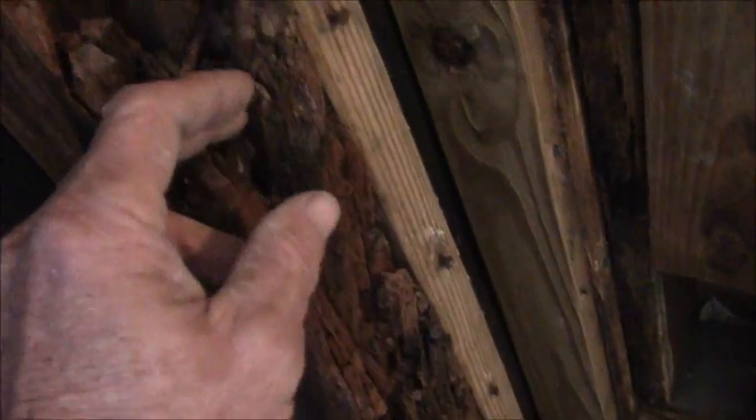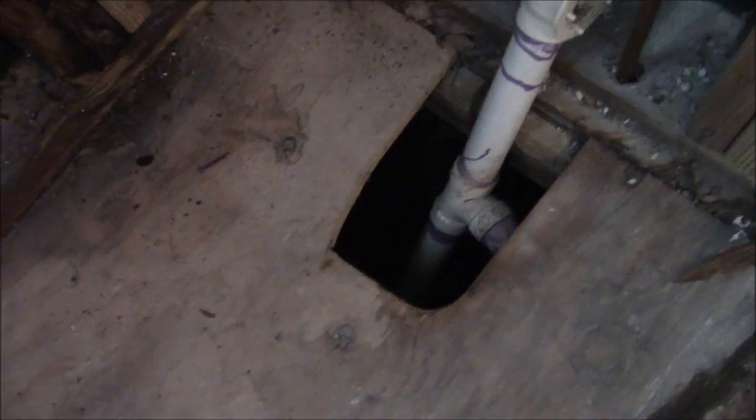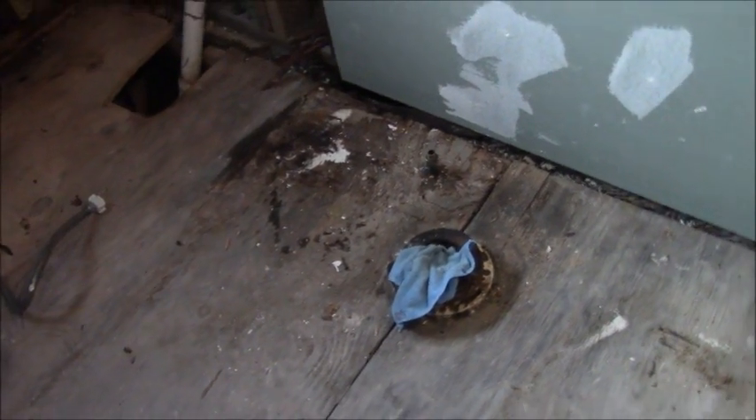There's a lot of prep that has to happen. All this wood looks like it's been through a fire — it's really rotted bad — so I have to refasten all of it. The drain broke off and I won't be using it anyway, so there'll be a two-inch drain installed. I'll most likely do a little series covering all the various steps it's going to take to get this back to a functional bathroom, and as the process progresses I'll come back and show what's going on.